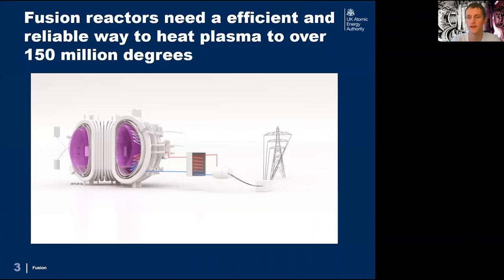Obviously we want it to be able to heat our plasma up to our target temperature, but there are a couple of other things we want as well. A hypothetical fusion power plant would be a pulsed machine, turned off and on periodically. The plant would probably hold plasma for about 23 hours a day before spending an hour off, then restarting — this cycle would repeat every day for months at a time. So we want our heating systems to be efficient and reliable. Efficiency matters because any power we put into heating we take out of power available for the grid, and reliability matters because if our heating system breaks we can't produce electricity and we'll cause a power cut.